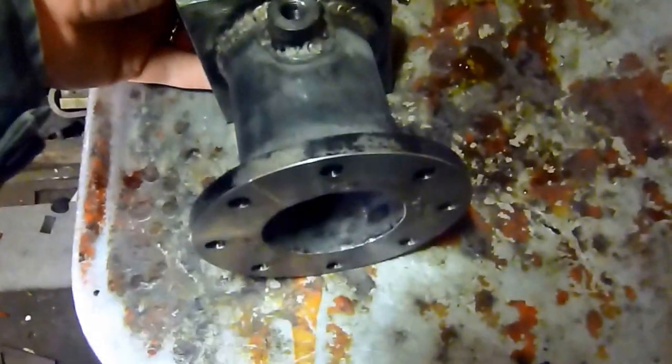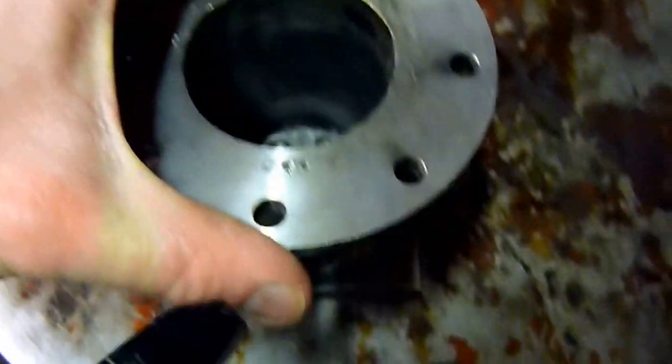What I'm going to do now — I welded that all in yesterday — is finally attach this to that so it's not going to come off anymore, because then all the inside of this has got to be lined with fire clay. I need to poke something through that hole so I don't bung it up. And then it's got to be cooked in the oven. So we've got the fire cement and we're going to give that a go in a minute.